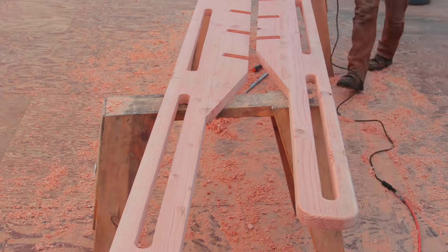Finally, the moment we've all been waiting for — assembly of this beautiful ship's ladder. I've got all my stair treads, I've got my two pieces cut out and ready to go, and now it's just basically stacking them together, screwing and gluing. I'm going to start by putting my top tread and my bottom tread in, and then slide all the other treads right into place. Get a nice amount of glue in there. I'm keeping the screws flush on the surface — you retain a lot of strength by doing that. While you're gluing up, always keep a wet rag on you, because if you let that glue dry, it's impossible to get off later.